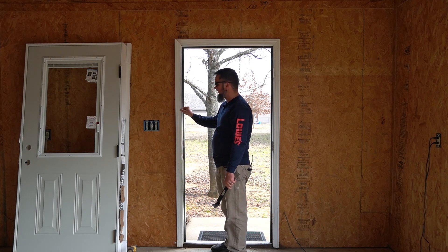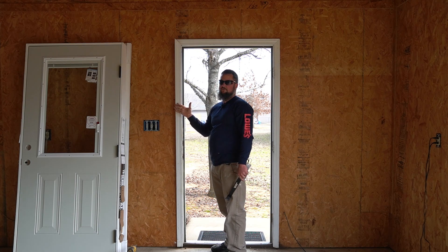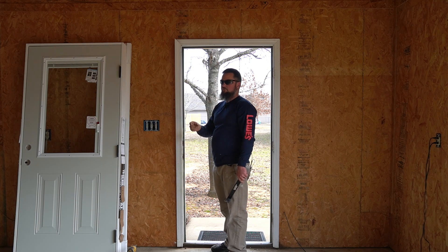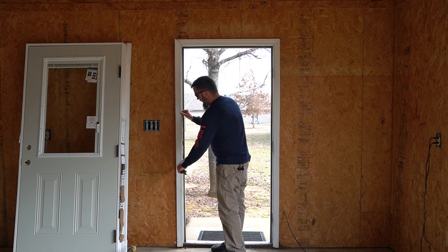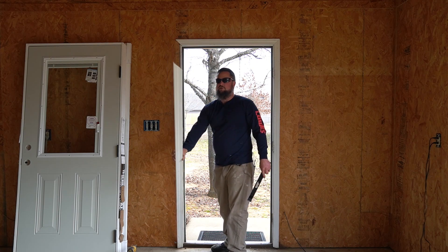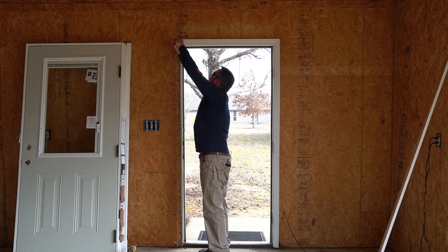A lot of times if you have trim that's sticking, especially if it's thinner — not all trim is 3356 — like the fancier stuff or trailer trim, it's real flimsy. You kind of have to bounce the bar a little bit rather than prying hard. In this case it's coming out easily, so it's hard to show, but you bounce it gently and the trim will come off without breaking. When you get to the top, a lot of times there's a nail through the corner and you need to lever it — if you try to pull it straight off it'll crack the trim and you won't be able to save it.